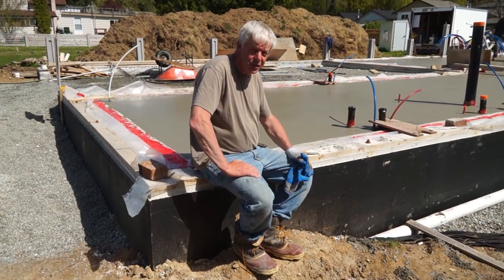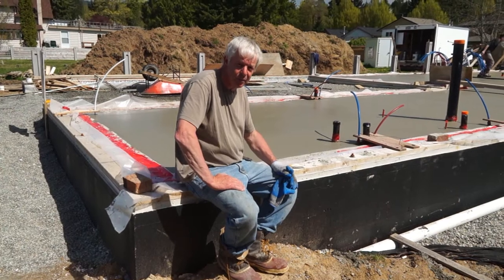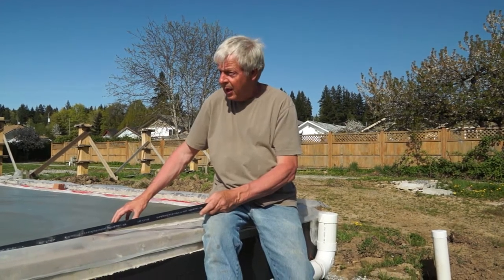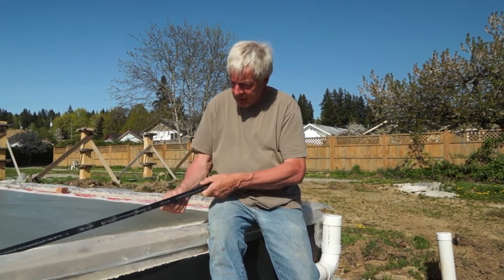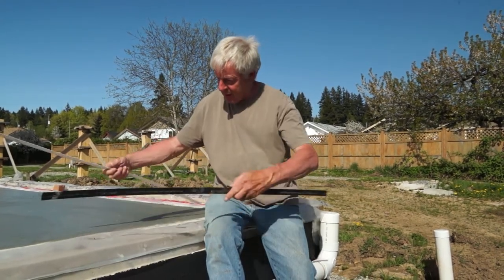It's about twenty-seven degrees Celsius, so tomorrow we will seal the concrete with a sealer to prevent rapid drying. We just finished sealing the concrete with a cure-and-seal product — its purpose is to slow down the evaporation of water so we get a healthy, strong slab. We also put in some zip strips to create controlled joints so that cracking will occur where we want it, not where we don't.